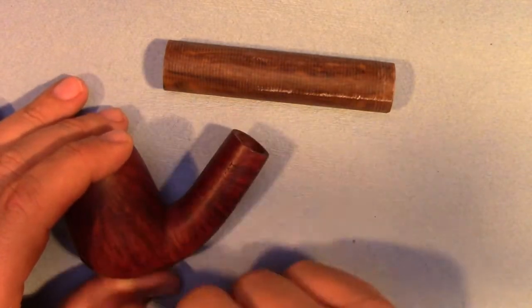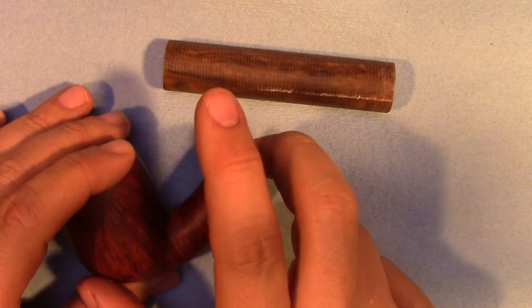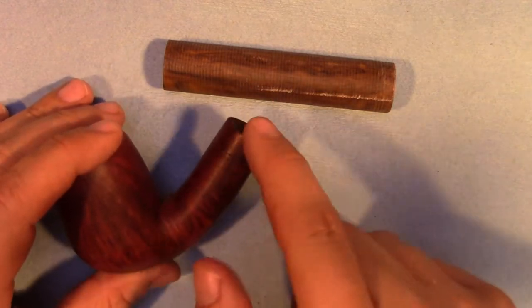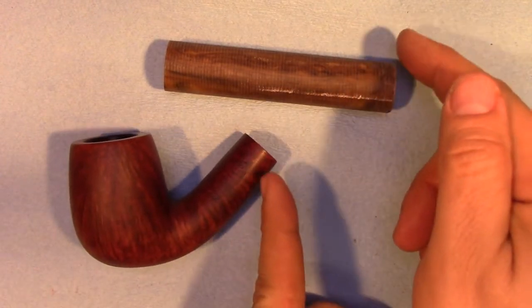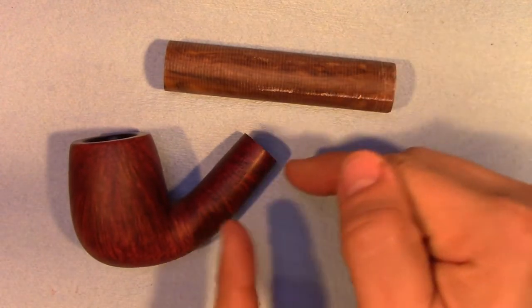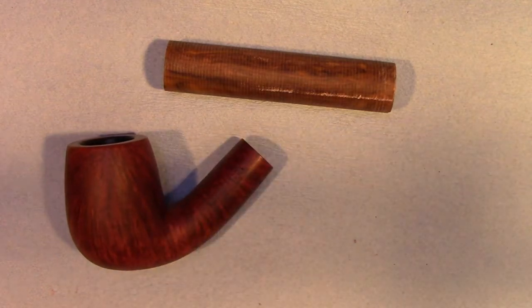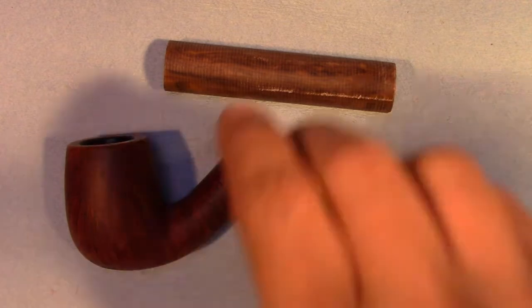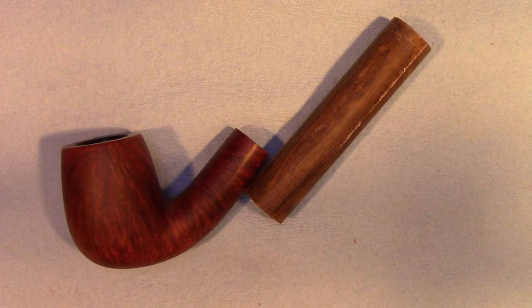The stummel — it's difficult to measure exactly, but we're talking about roughly a 3-inch distance from end to end here. And so we'd like the stem to extend out about 3 inches. I know that the tenon is going to have to be about 5/8 of an inch, so we're shooting for a 3-inch stem when we're done, and that'll keep everything nice and in proportion.